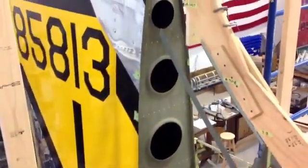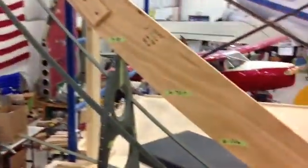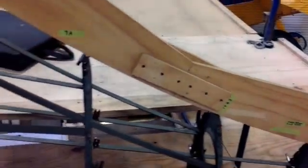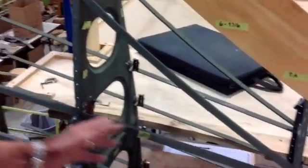I'm Carl. I'm from Westerville. I come over a couple days a week. What I'm working on here is the intersection of the dorsal fin with the vertical stabilizer. This plywood template is a 140-inch radius arc, and that represents the top of the dorsal fin. And these are the major ribs of the dorsal.